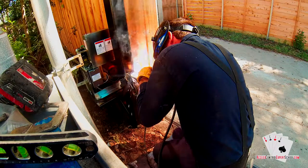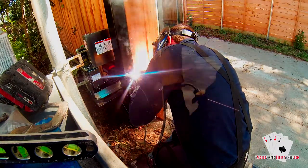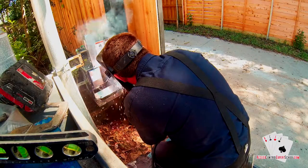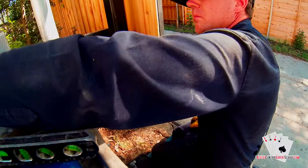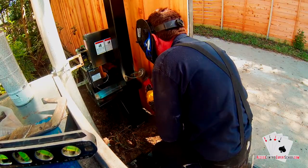This particular bracket is being welded to a very heavy guide post so we're having to burn it in in a couple of different spots. We did two welds on each side, and after we're done welding we're going to brush the welds to prepare for paint.